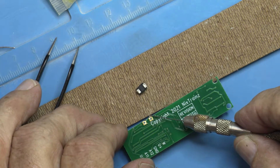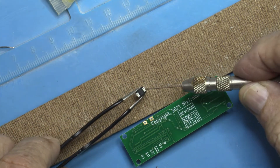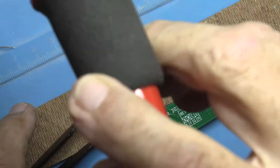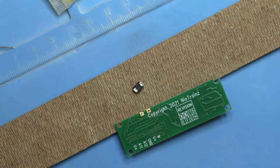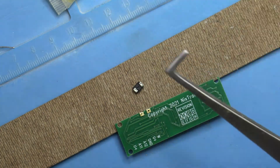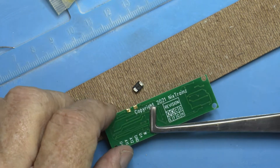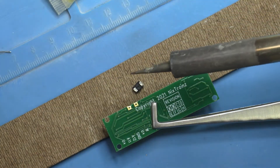First, I'm going to use just a little bit of flux. I like ChipQuick on both the decoder buddy and the TVS. It took longer to set up the demonstration than it did to actually solder the TVS's onto the boards — it's a very easy procedure. Jeff Bunza mentioned that it's good to stabilize at least one part of your project, so I decided to stabilize the decoder buddy.